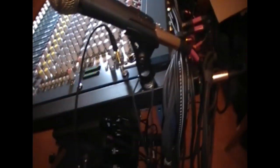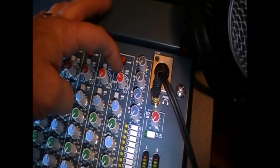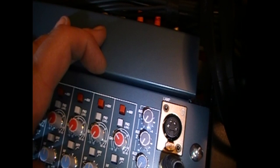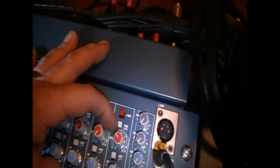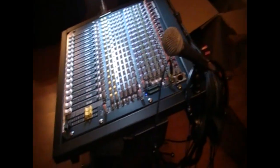I've got my little talkback mic here — I drilled a hole through it and mounted a mic clip on there, so my talkback mic is right there and I can grab it and use it. I've got the talkback on the XLR side of this. Since this is my effect return, if I push that in, I'm running the effects; if I pull it out, it's going XLR. The only time I really need talkback is during soundcheck — during the show, pop that in and these two faders are my effects. If I need the extra channels, I can just take those out. That's my setup.